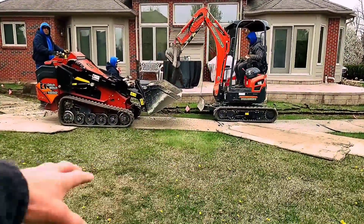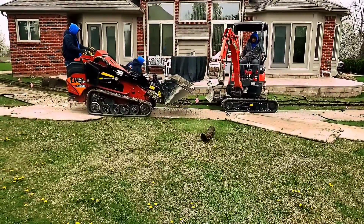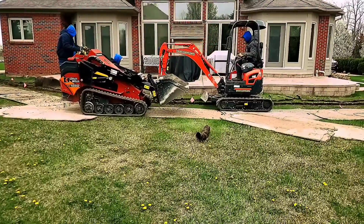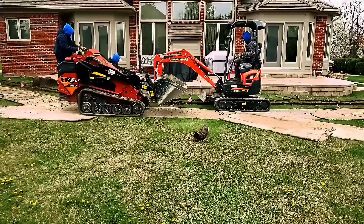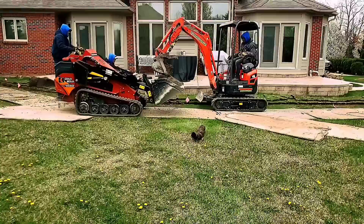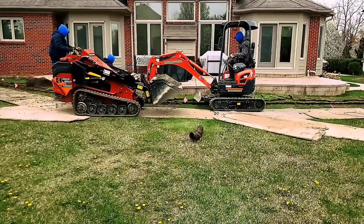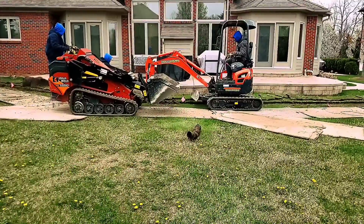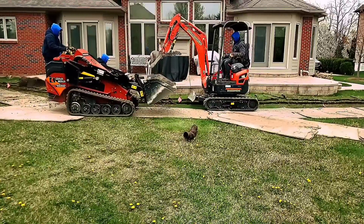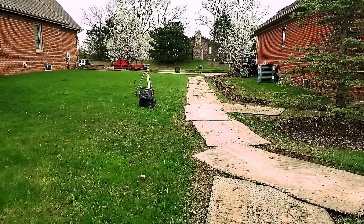The yard is super flat right in here, it's extremely flat. That's why when the water comes off of this giant hardscape — it's a non-permeable surface — you have all that surface area catching water. All the sheet water starts to be shed off this large concrete deck. When the grade is real flat like this, the water has no way out. It just hangs around and everything gets saturated.